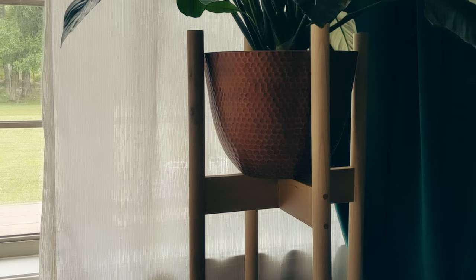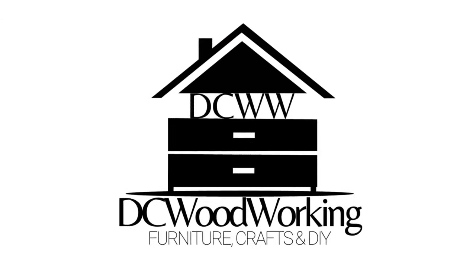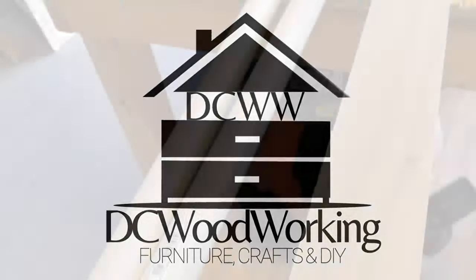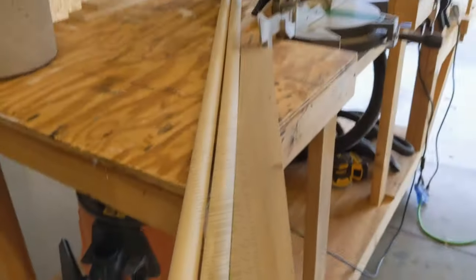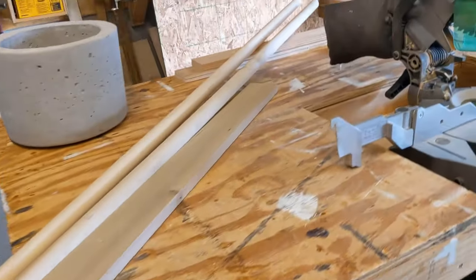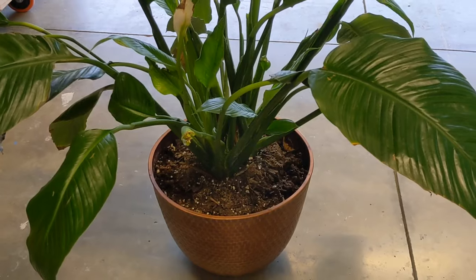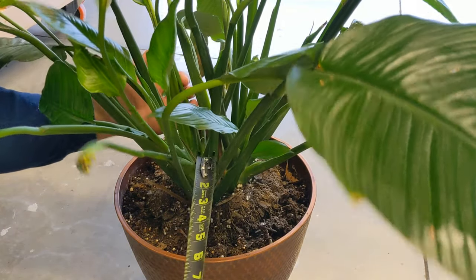Today I'm making a modern plant stand. For this project, I used 1 1/4 inch poplar dowels and one 1x3 piece of poplar. I started by measuring the diameter of the pot that I was going to use the plant stand for. Then I cut all my pieces to size. The material list and dimensions will be in the description of the video.